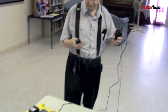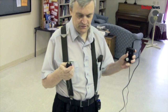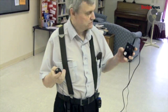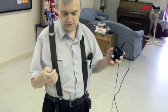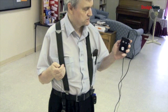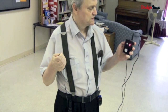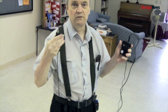Okay, as you can see, I can turn it up and down. You can hear the speed change. I normally use it on the lowest setting for what I do. If you squeeze the spindle so that it can't maintain the speed, the overload light comes on. If you let go, of course, it goes out. If you stall it for 3 seconds, the motor shuts off. Then you got to turn it off and back on to reset it.